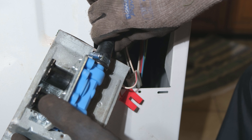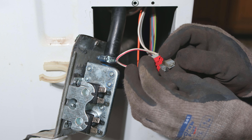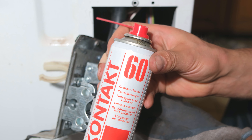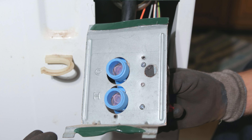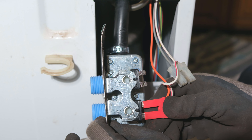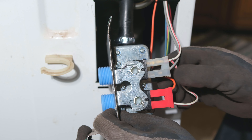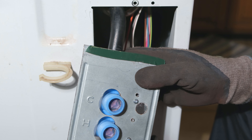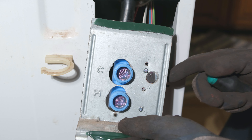I haven't fastened the clamp yet but I can already see it's quite tight, so this is going to work very well. The next step is to connect the connectors. I've noticed inside these connectors they're looking a little corroded - some moisture has obviously gotten in. I'm going to use a contact cleaner to help reduce the oxidation - just a little spray in each one. On the face plate the hot is this one and the cold is this one. The hot connector is red, and it doesn't matter which way it goes because this is just a coil inside the solenoid. Before tightening, I must get it in the correct orientation to avoid unnecessary pressure on the pipe.